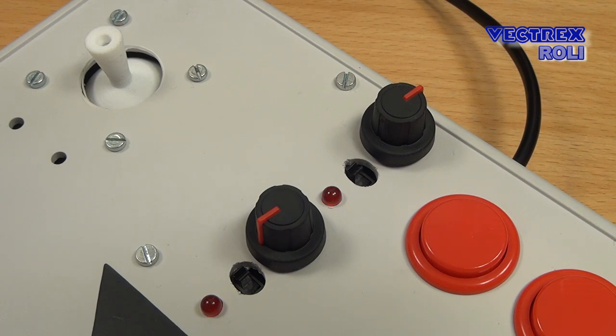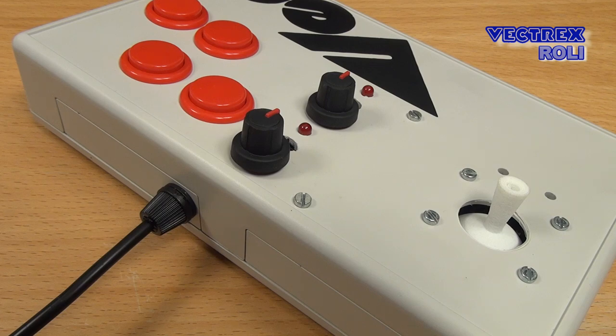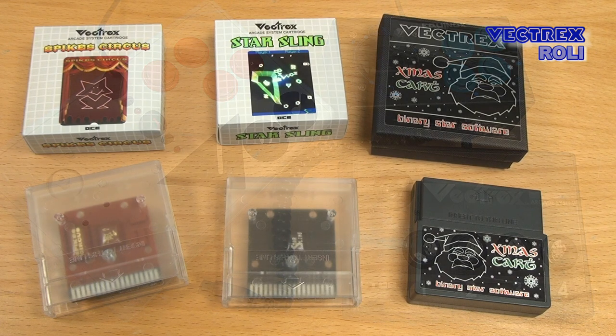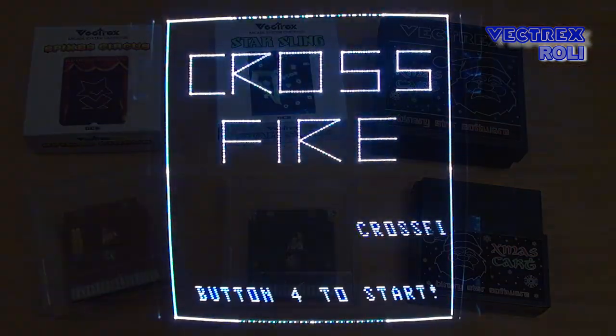Of course I knew my own results would never look as nice and professional as Toby's controller. With Rolo's kit you don't have to look for all components separately — you get a 3D printed stick to put on top of the analog controller, and even a nice looking cable relief for your joystick cable. The only thing you need to be very careful about is checking each pin of the joystick cable separately before soldering, otherwise you could destroy something. Here we see all three homebrew analog sticks I currently own. The black-blue one is from Fury Unlimited, which you can see in more detail in one of my older videos.